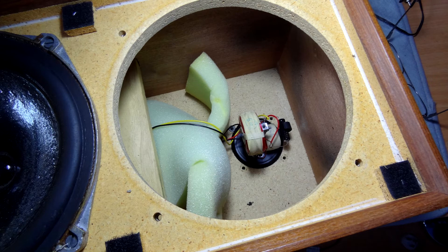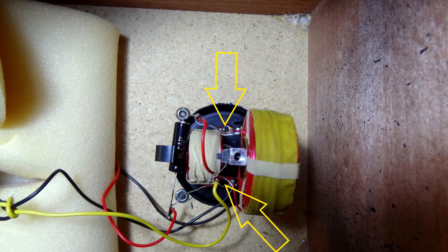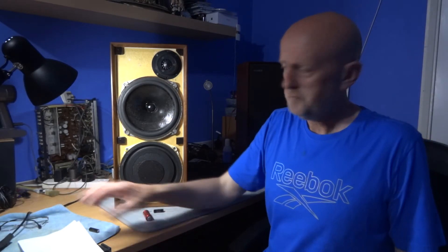I soldered it on, making sure I had a nice good fixing of solder, then placed it back into the enclosure. You can see where the two nuts had come undone from the wood — I needed to hold them in position while tightening the bolts from the rear of the speaker. Once that's all done and back in place, I tightened the two screws that hold the terminal wire connections onto the crossover — they were just a little bit loose. One needed about half a turn and one about three quarters of a turn. So there you have it, all back with the foam in place and one speaker done. I did pretty much the same with the other speaker.